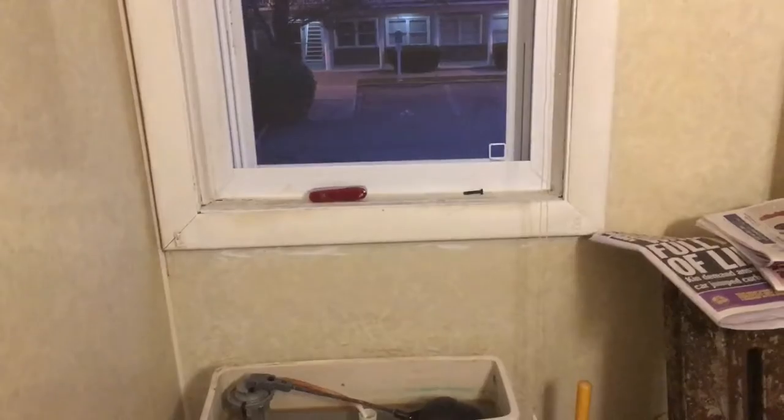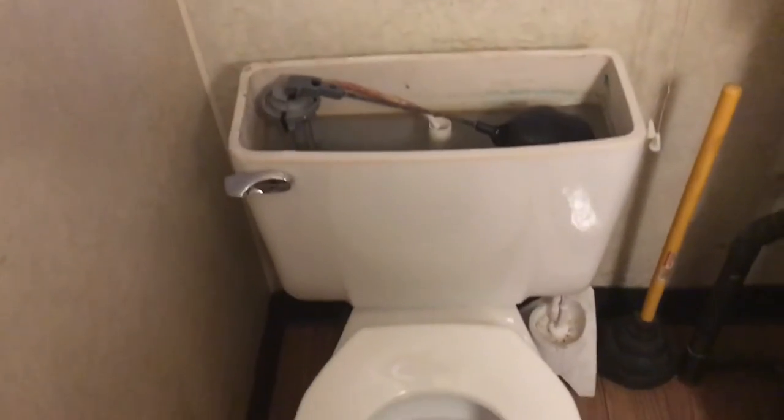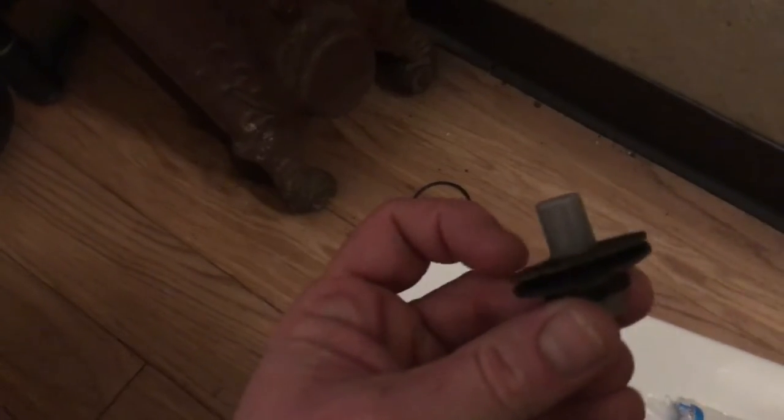Hello, friends of the internet, this is Liam Brown. The 1983 American Standard Cadet has finally been properly repaired. I finally got the repair parts in the mail to fix this ballcock. The piece that was making it spew water out of the back was this plunger inside it. The two washers here were badly worn out, which was causing them to fail. The ballcock didn't shut off at the end of the fill cycle — it would kind of slowly hiss and then stop.